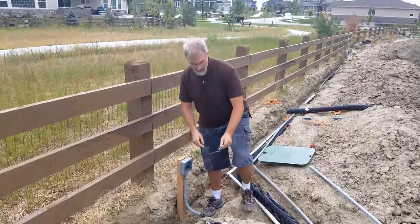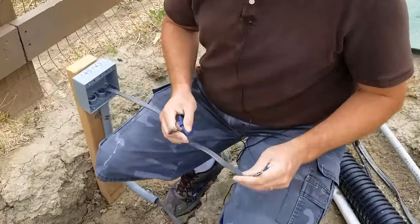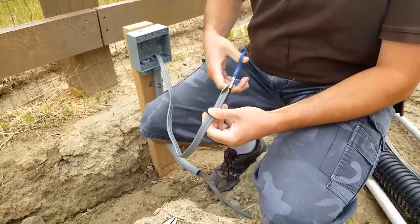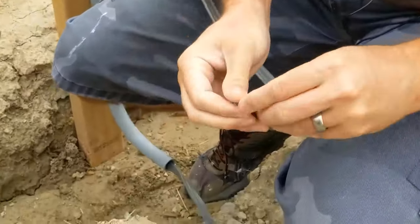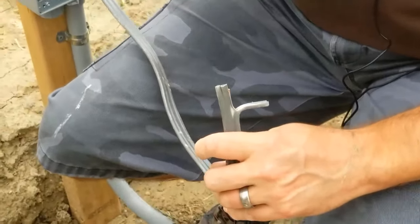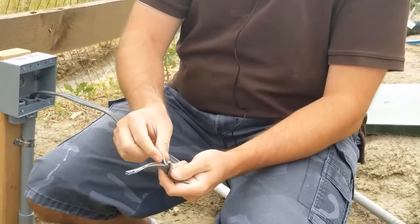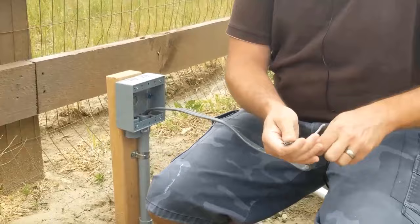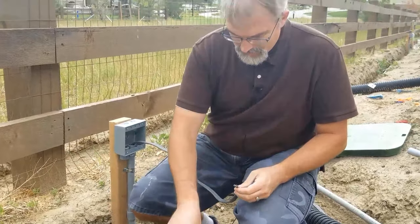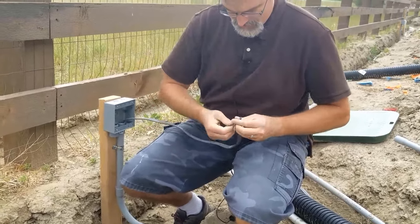The wire pulled through just fine. Now comes the fun part — stripping the wire. I'm probably going to do a rough job of this; there are videos showing better technique. I'm just going to use heavy-duty scissors to cut the outer jacket apart a little bit. Inside we have four wires in this case — you only need three, I overkilled it. The important thing is not to cut the wires inside while stripping the jacket. I gave myself a long stretch to work with. It might be a good idea to use gloves because it gets rough.